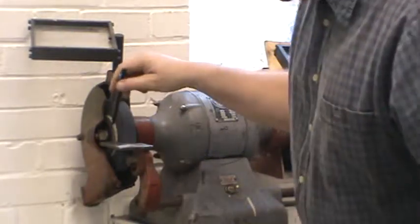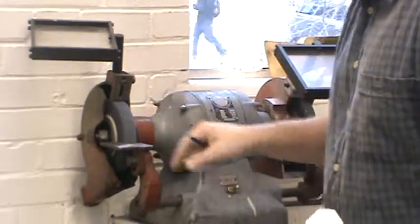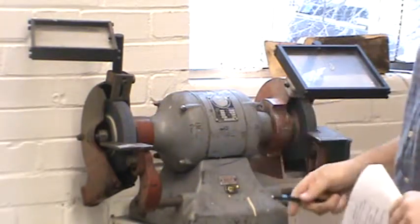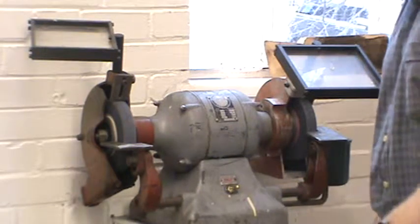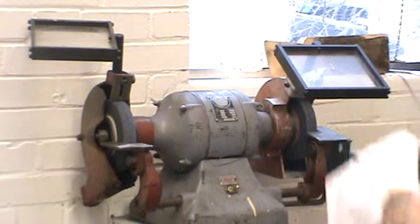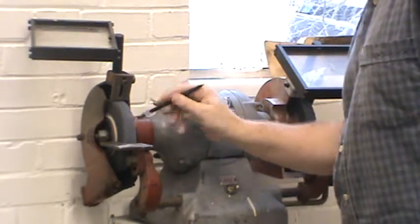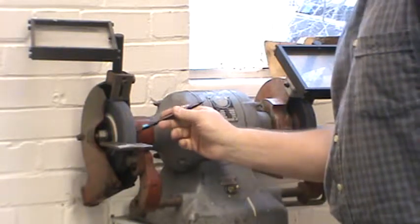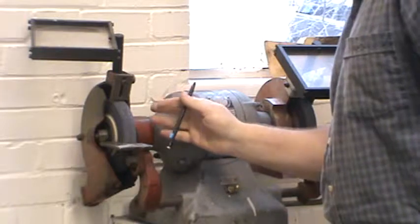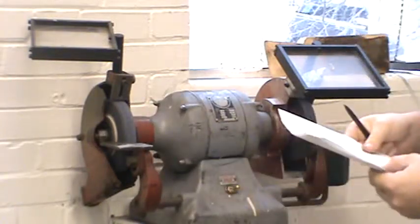Make sure the blotter is on both sides of the wheel, and don't have any combustible materials in the area of flying sparks — don't store gasoline nearby. You don't want to grind on the side of the wheel as opposed to the periphery or face, unless it's specifically made for that. These wheels are not made for side grinding. If you grind on the side, you undercut the wheel and weaken it, and the centrifugal force can cause the wheel to fail catastrophically.